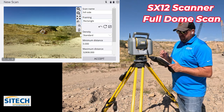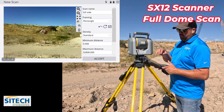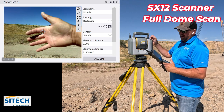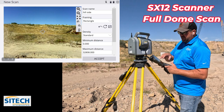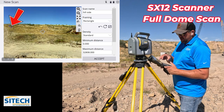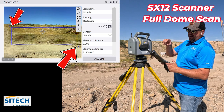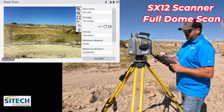So when you're on rectangle, you don't physically have to turn the total station out here to where you want it. You can see that you've got the camera on the front right here running, and you can see it on the screen. If that's where I wanted to scan that hillside, I can click a high or a low, and I can hit down there. And just a top and a down, or a down and a high, and it makes a rectangle there. That's going to tell it to just scan right there.